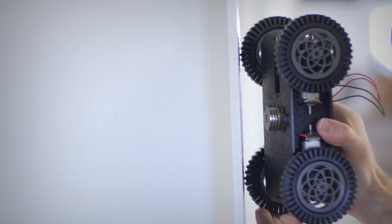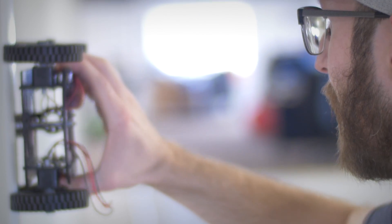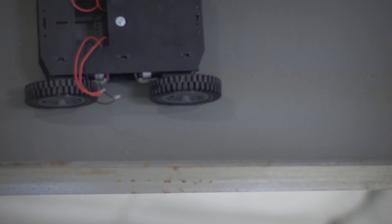This is my simplified version. In the last version I had way too many magnets, but through trial and error I realized just four stacked one-inch magnets would be sufficient. With these wheels the spacing is just right, and I'm holding them together — holding the whole robot together — with a standoff on the inside that's cinching it together, compressing it slightly, which is perfect for what I want. So this build should not only hold together, it should be very sturdy. Spacing looks just right, it holds really well, and there's still enough play to move around. I'm encouraged by that.